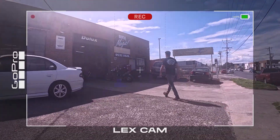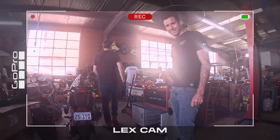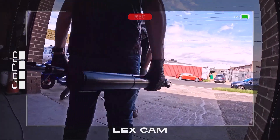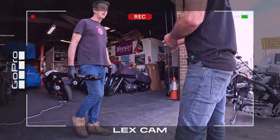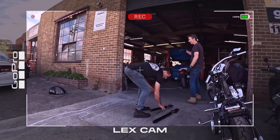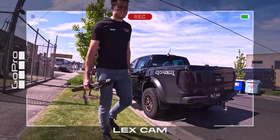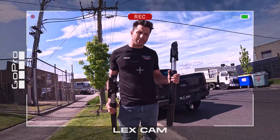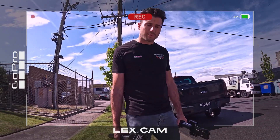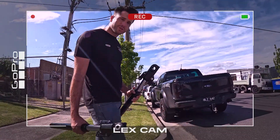After a little bit of time on Google, I found Bike Magic down in Moorabbin who gave us a hand. The forks were really badly bent, so it was wishful thinking that we could straighten them and use them. The guys pulled all the shocks apart, heated them up and tried to get them straight again, but the tubes themselves were out of round, so even when you compress the shock, it leaks oil. Bike Magic did some magic on our shocks — we weren't actually going to use them, but we thought we'd give it a shot. Worst case, we can use these as a setup, get the whole bike set up and make sure it works, then get something else. We've still got a fair few angles to play with because we've got a bigger wheel and we want to lower the bike closer to the ground.